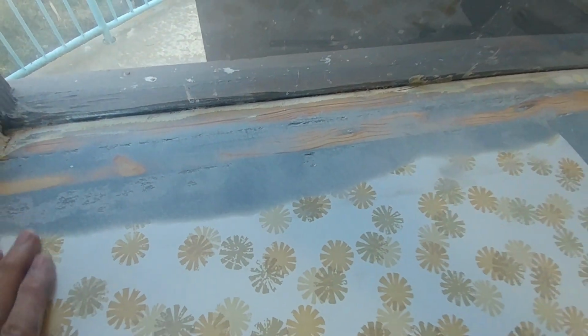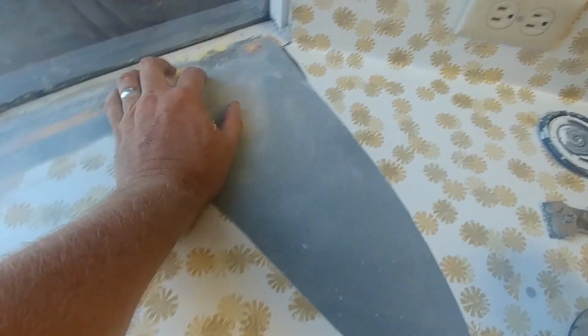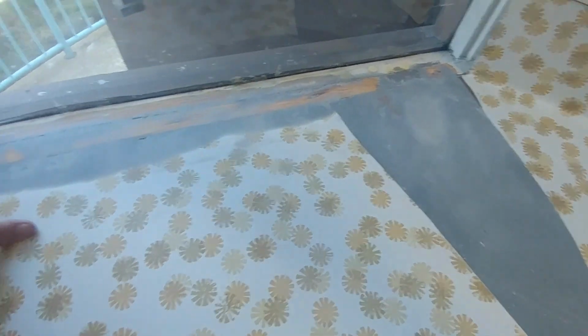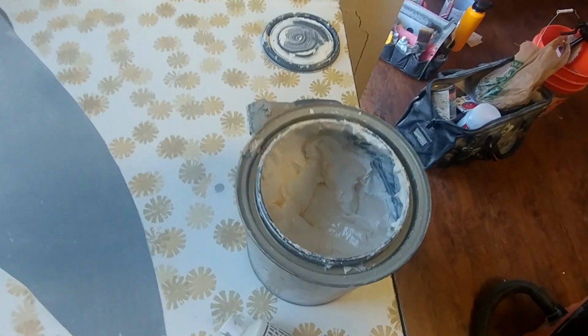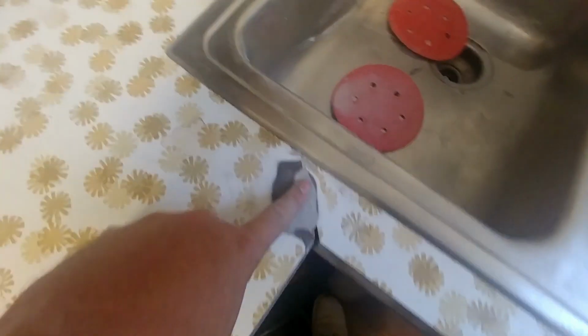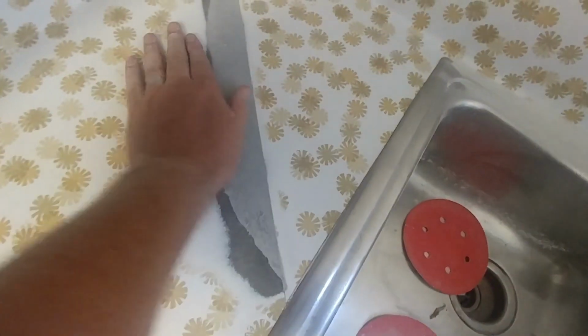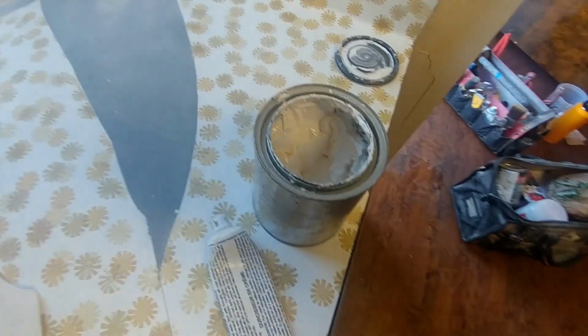There is a slight bump here, which we're going to level and float out, with all these little pinholes and little areas like this. All these little spots here along the edges are going to be filled with our polyfill. And this one has been done, and then this one floated. So next we're going to put this on and we'll come back to you.